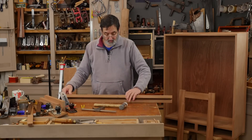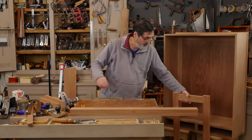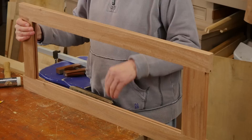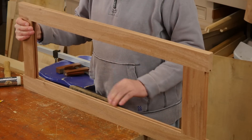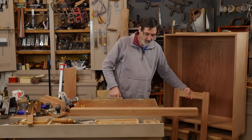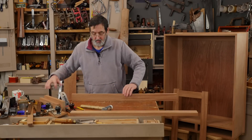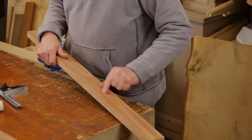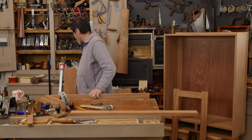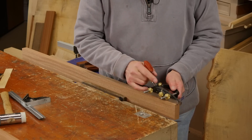What we're going to do is make a frame just like this one, where we've run the groove on the inside edge. This one happens to be centered; sometimes they're offset one side or the other. I want mine centered - it's going to have a panel in here. So my first step in making this door is going to be running the grooves, and once I've run my grooves I can run the joinery layout. I've got my face mark and face edge, so I'm going to start with my plow plane, which is already set because I just made that door.